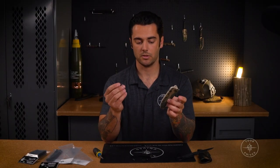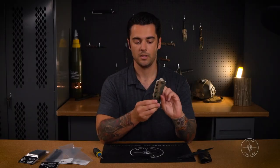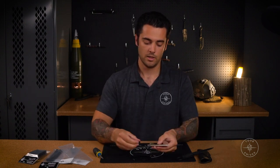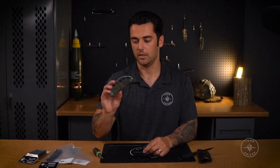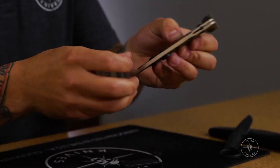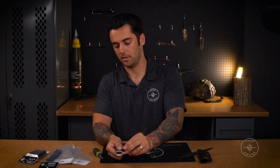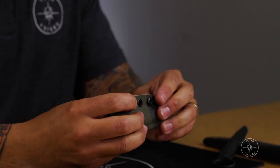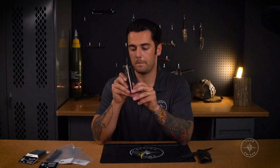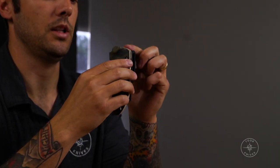Take the female screw and set it into that fourth hole. Since I want the mount on the back side of the sheath, I push the female screw through the front all the way to the back, then take the spacer and use that to hold it in place. Same thing for the fifth hole — pop the spacer on the back. We use these spacers because we don't want the mount flush against the sheath; we want a little bit of separation. Then take your male screw and tighten it — not so much that the bushings start to squeeze out, but tight enough that it won't fall off during a mission. There's your IWB clip, completely level with the top of the choil of the sheath, which makes it really nice for concealment because the sheath isn't above the belt line.